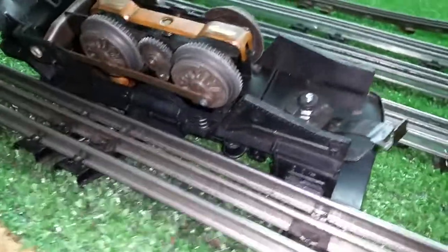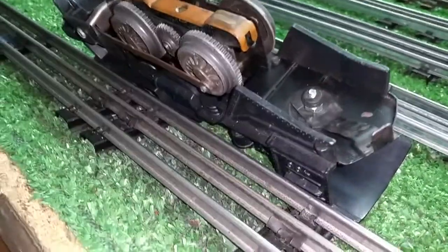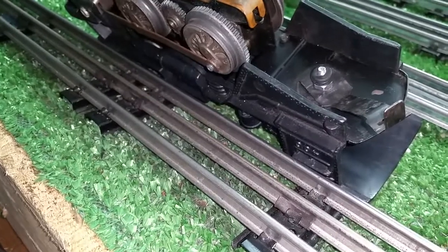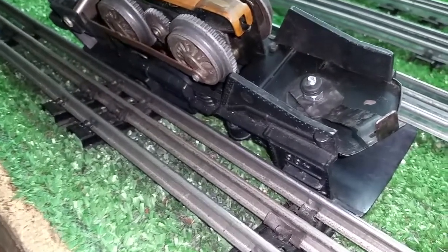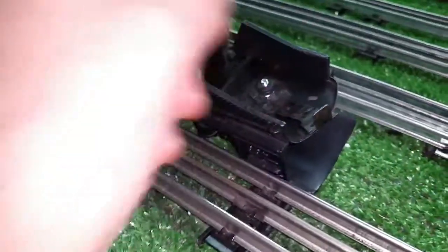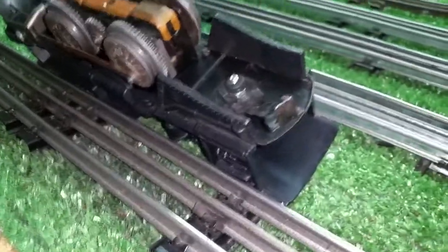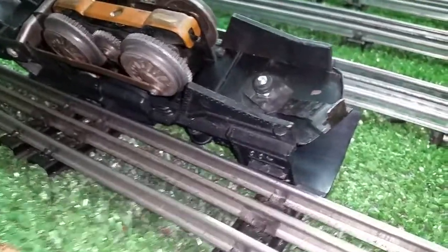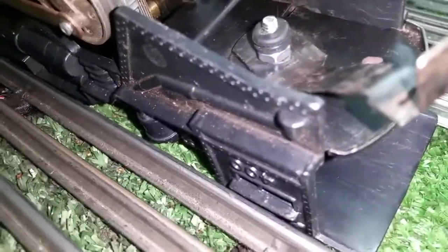It works really really well. You can get these grommets at Ace Hardware, and I use these quite often for locking the nut onto a screw. It's really simple and it's reusable. If you want to take it off, just pull the grommet off, take the nut off, take the screw out, and replace it with a rivet. But if you don't have a rivet set, it's really simple just to use that screw, a single nut, and then that rubber grommet.